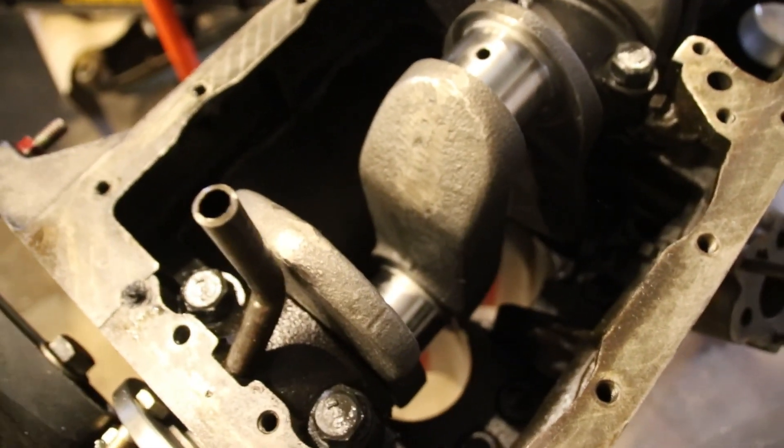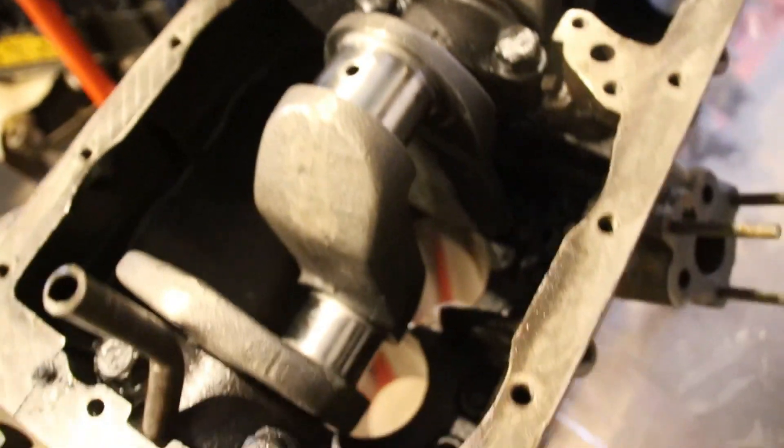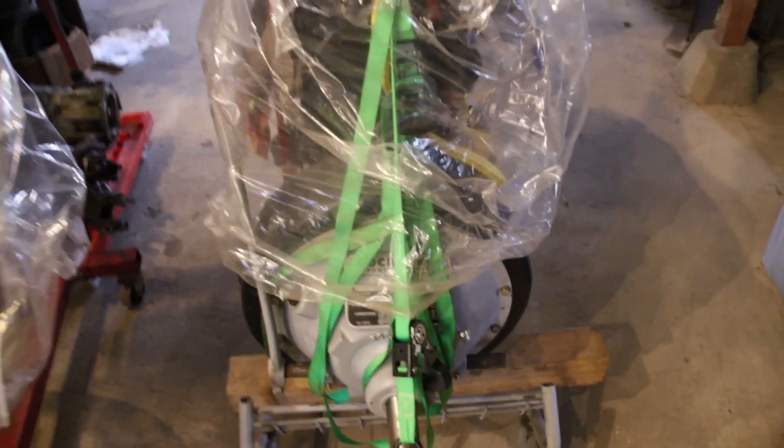Here is the Chinese block and I was able to get a crank ground up perfectly and put in there, so the crank is in there and the valve guides are in and the valve job's done and everything. So that one's coming along. And here is the AmeriCar engine — every now and again I come across new old stock cranks, and I did buy one a while ago and was waiting for a project for it. So there's a new old stock crank in this Willys AmeriCar engine. And I've got the engine that was going to go in a snowblower Jeep — it's got the Rockford clutch on it still in the bag. We'll talk more about that one later but let's get busy on Bertram.